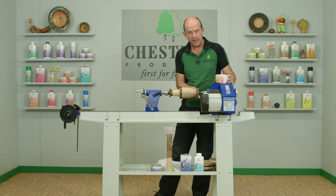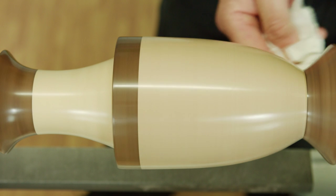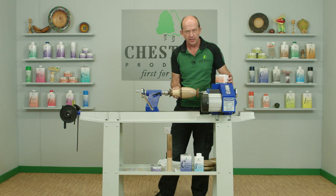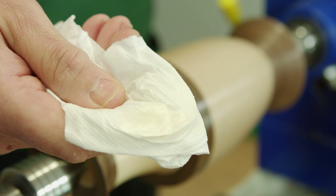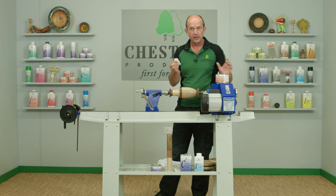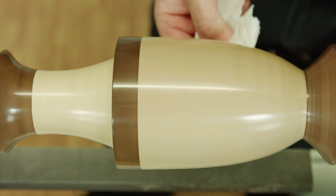Polishing up straight away is important because it's almost inevitable that you'll put slightly too much wax on. Buffing it straight away will remove the surplus wax, and you'll know if you've got it wrong because you'll get streaks in your work. So make sure you buff it up straight away — don't leave it 15 or 20 minutes. You can see the slight amount of wax coming off; it's the surplus wax you don't want on the surface. Fold that over to a fresh piece of cloth and do the final buff up.